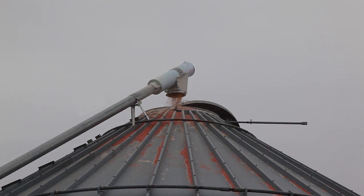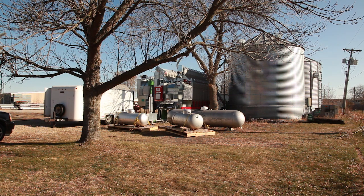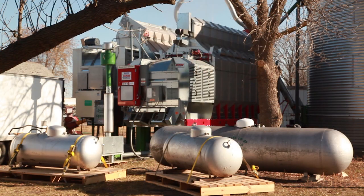This same stabilization period was repeated on day two when the Super B SQ20 was tested. Once the stabilization period was complete, we switched from the large LP tank to a smaller LP tank secured to a pallet. These smaller tanks were weighed before each test began and after each test was completed, giving us a very accurate accounting of exactly how much fuel was used to dry the grain.